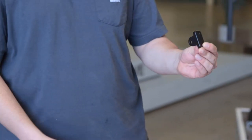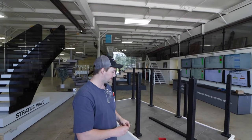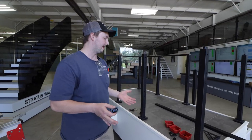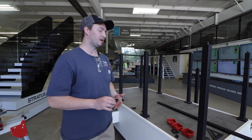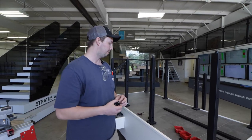First thing I want to talk about is the brackets. This is a standard universal top quick slide bracket. The bottom side is chamfered for a machine screw, and these holes are access holes for our dome screws, which we use to attach the bracket to the post. A huge feature of the quick slide is that we don't have to do any drilling into our stainless, so we're not going to break the powder coat. All of the components to tighten this are made of aluminum, so no galvanic reaction can potentially occur, especially for those of you in extreme coastal environments.